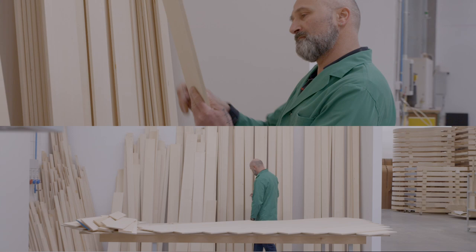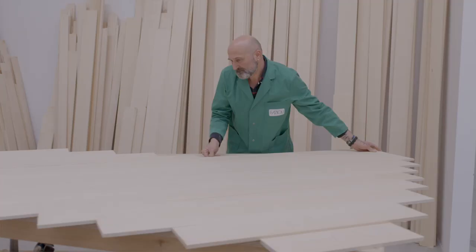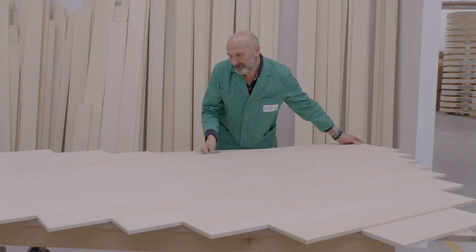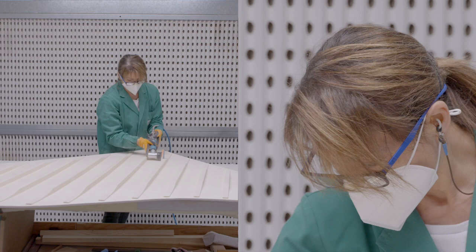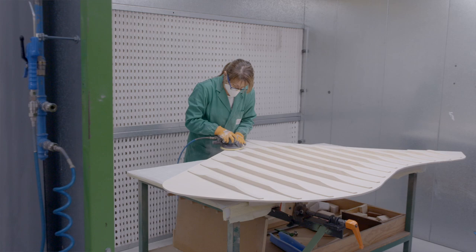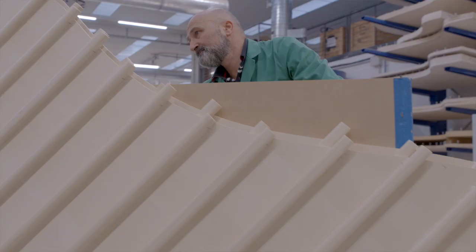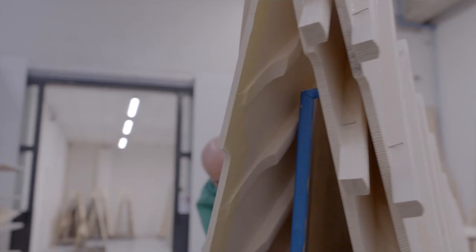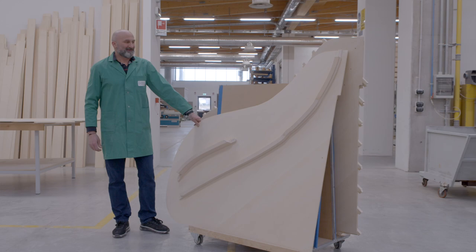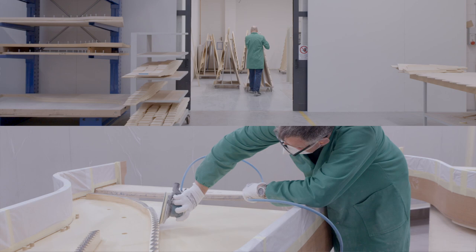Several planks of different lengths are glued together by hand, which requires specialized craftsmanship. When the board is cut and smoothed, it has to rest for at least two years. After two years, the soundboard is planed down by a pneumatically controlled machine — no mistakes can be made here because the way all frequencies resonate largely depends on this process. By gluing ribs to the soundboard it gets a convex shape, giving it strength and acoustic efficiency. Two bars are glued to the soundboard for the strings, and finally a varnish is applied to protect the soundboard from humidity.